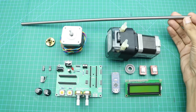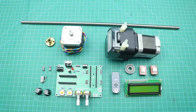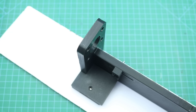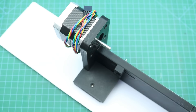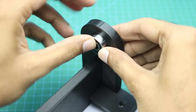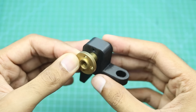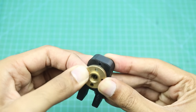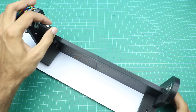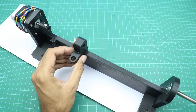Here is a 40 centimeter long screw shaft — for this project we only need 30 centimeters, but that's what I have available. Here is a nut for this shaft. Now we will connect the stepper motor, then the ball bearing goes in its holder, then we insert this nut into the pipe holder, connect the shaft coupling, and finally insert the shaft.